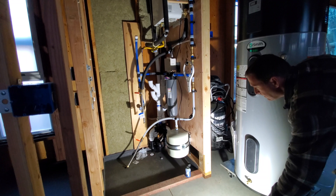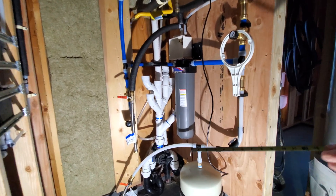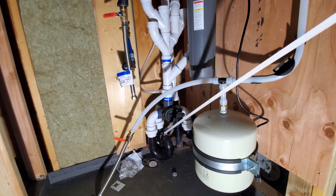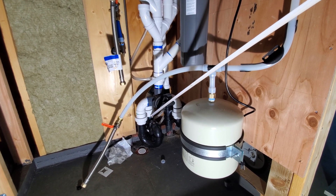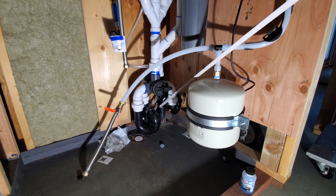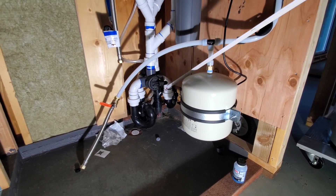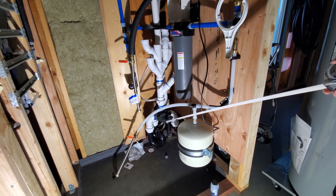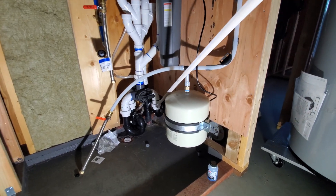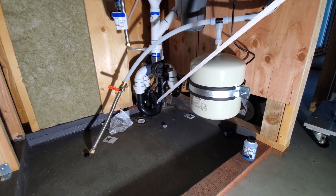Back here in the corner is this drain tree setup. There are two possible ways drain water can go. One is a trap that connects to the main underground drain line going toward the septic. The other side goes straight outside for laundry-to-landscape water drainage — in our county we're allowed to drain laundry water directly outside for irrigation or evaporation, without it needing to go to the septic. This valve can be switched back and forth between the two options.